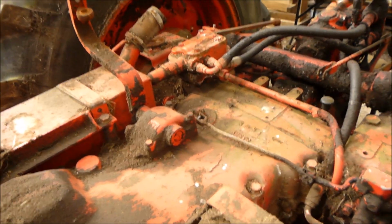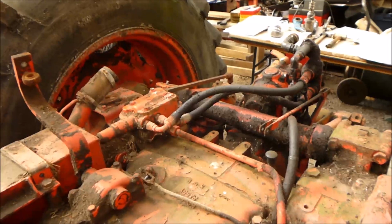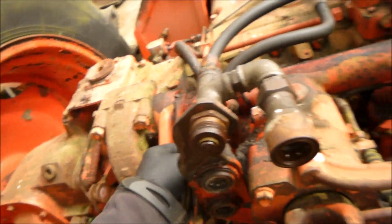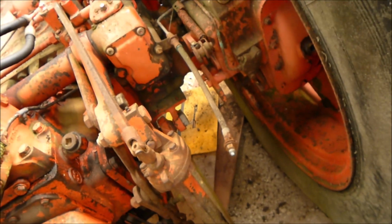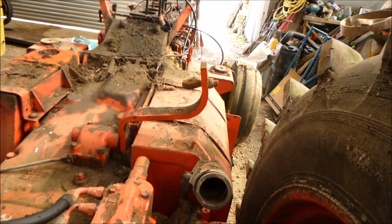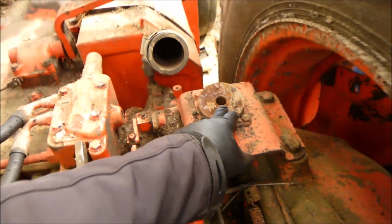Gear linkage, I had to come out from the cab and unbolt the lever from inside the cab. Then obviously all the hydraulic levers got off, all the hydraulic controls, the levelling box lever, PTO thing, handbrake cables, PTO clutch cable, they're all easy to do as well. And then I unbolted the hydraulic lever control thing because that had the linkages sticking down still, so I took it out so the linkage wasn't sticking out, so I could put the cab flat on the floor. And again, just four big bolts which are relatively easy to get out as well.